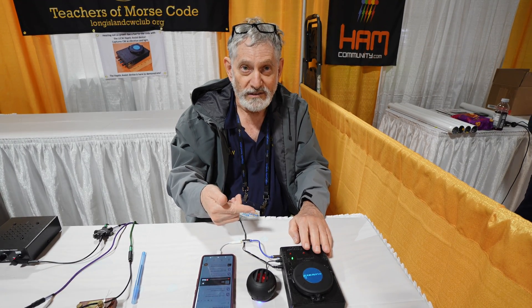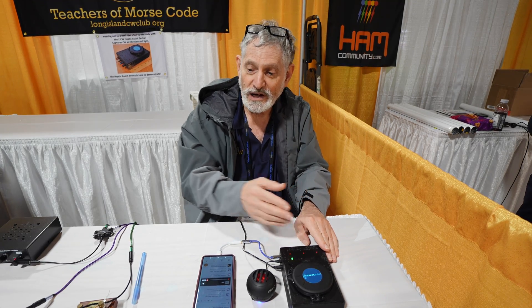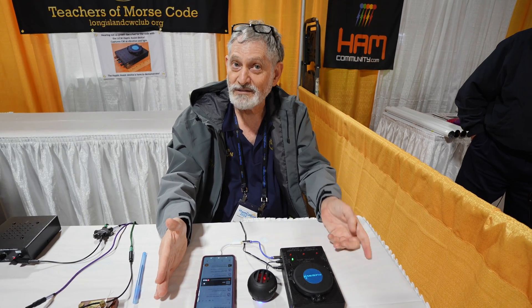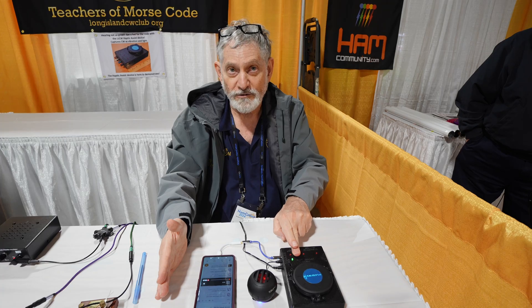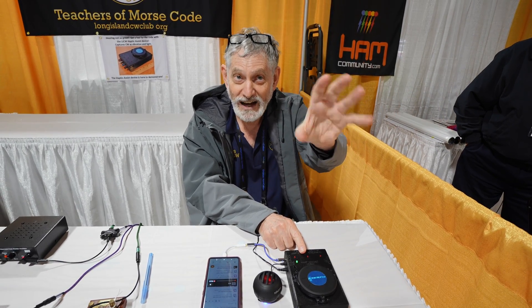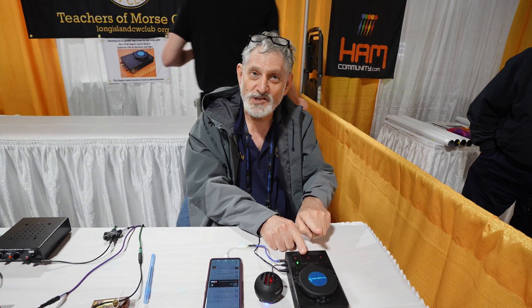Other things you can do with it: this device is tuned to a frequency. When I key my radio, it's set for a particular tone — 450 hertz, my sidetone. I can key, not transmit, but key, get a tone, and tune this to 450 hertz. Then when I'm tuning across the band, I can zero beat somebody — tune them to 450 hertz with the big knob — and now I'm zero beat on them. So you can use it to zero beat, and then once you zero beat, use it to copy.